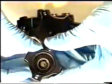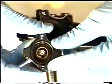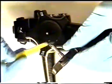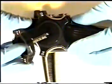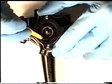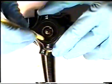We will now reapply the left-right knob assembly. Again, be sure that the letters and arrows face towards the head of the instrument. Clean off any debris using your paintbrush and white lithium grease. Slide the left-right knob over the shaft, feeling the shaft going into the body section, making contact with the grooves inside the chain drive assembly. Using your paintbrush with white lithium grease, clean off the left-right pressure plate.